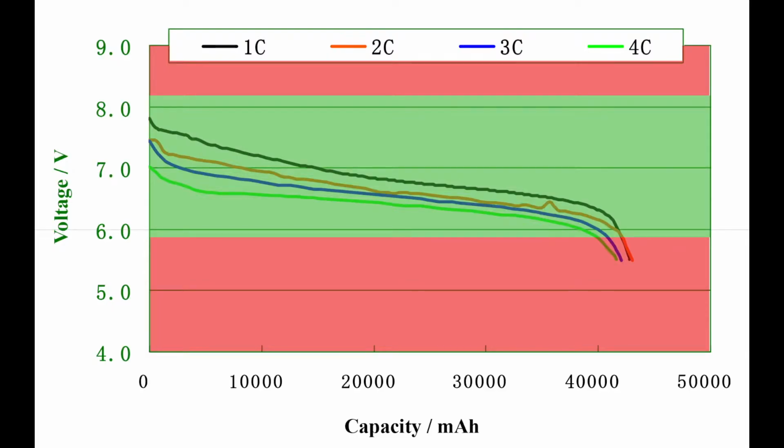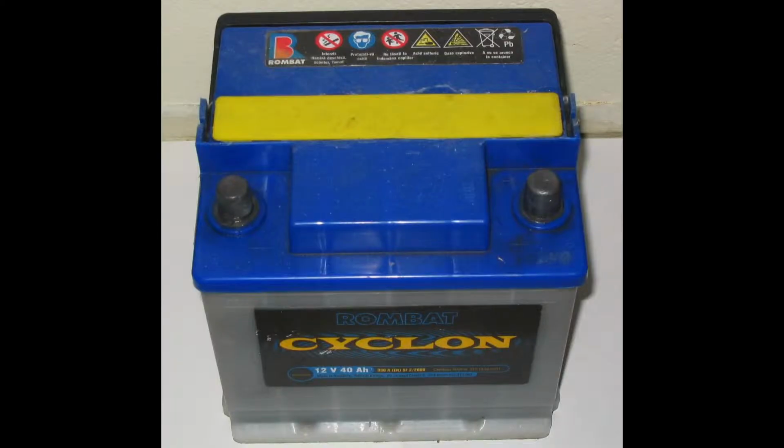Among other things, they really don't appreciate being overcharged or over-depleted. So, in contrast with, for example, a lead-acid battery, where you can pretty much ignore the fact that you have a 6-cell string, with a lithium string you really should monitor every individual cell voltage and probably their temperatures too. But that task is a little more difficult than it sounds.